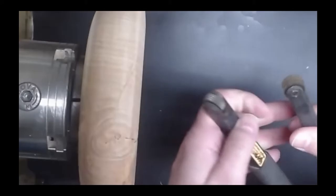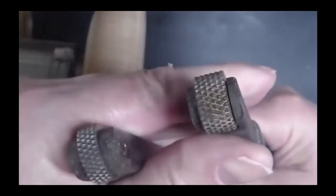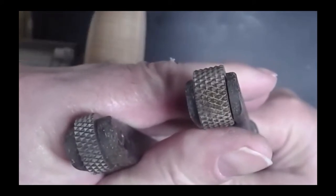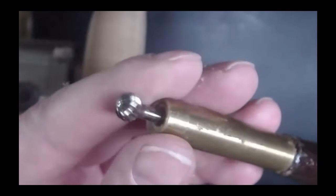Eddie asked me to show how I did this texture and the metallizing. A lot of the tools I use primarily are these two black ones here — these are Wagner knurling tools. I don't know if you guys can see the teeth on those. And I like the Henry Taylor Decorating Elf a lot — it just has these little burrs that come with it, they just pop in here. This is not a very big tool. I also use the Sorby texturing tools.